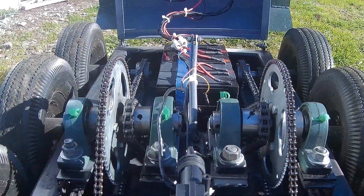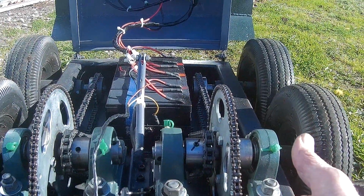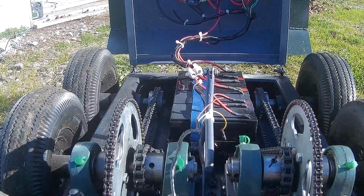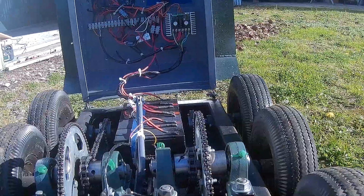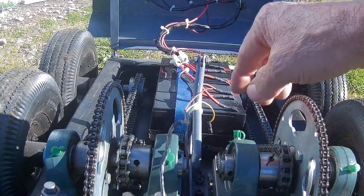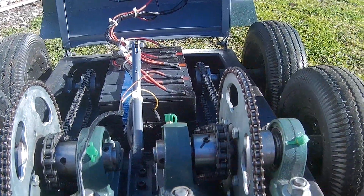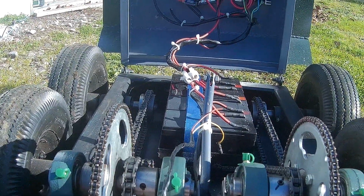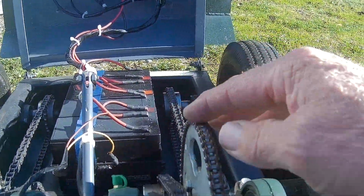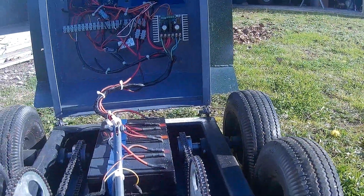So we've got two 300 watt motors, driven by not Chinesium chains, but we've put Japanese chains on here because there's so much torque with these two motors. This thing here is probably 50 kgs, and there's enough torque that when you spin it into a circle, the floor was bowing and all the chains would get loose. So in the bottom I've got another big piece of steel all the way across to stop the floor from bowing, so all these mounts will stay nice and steady. It's got one reduction there, and a second reduction there, and then it's straight across onto the wheels.